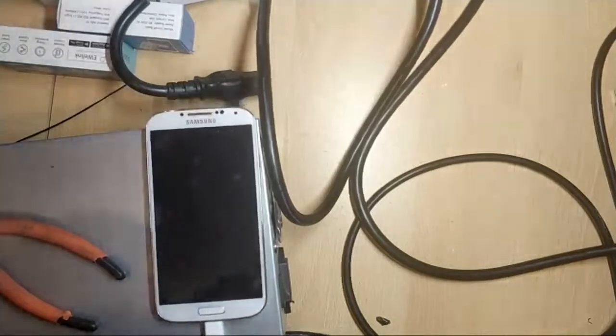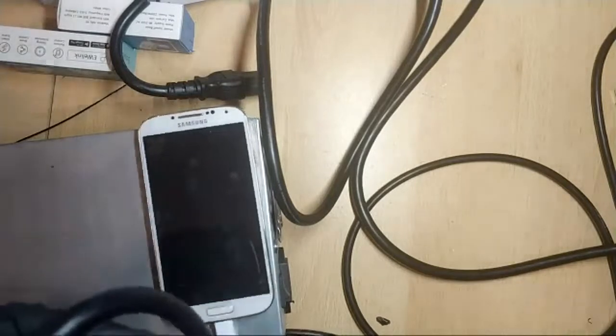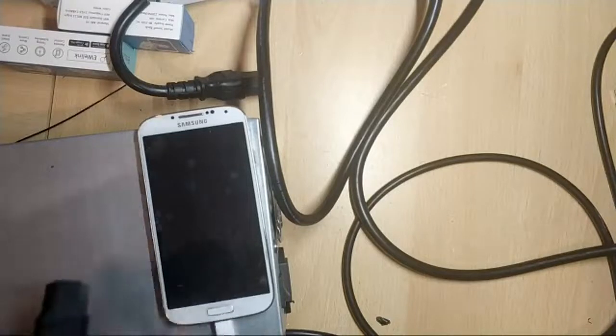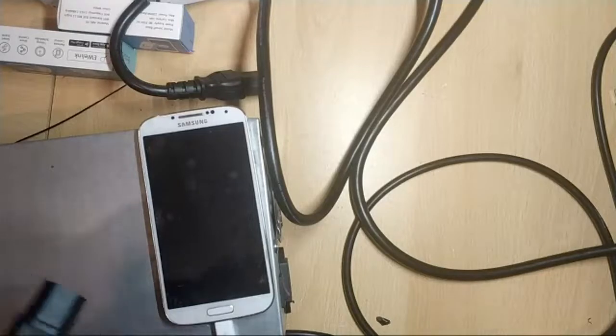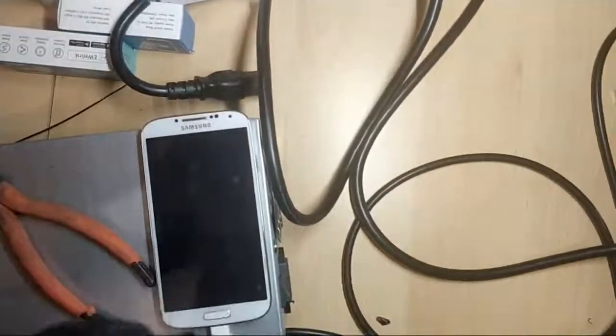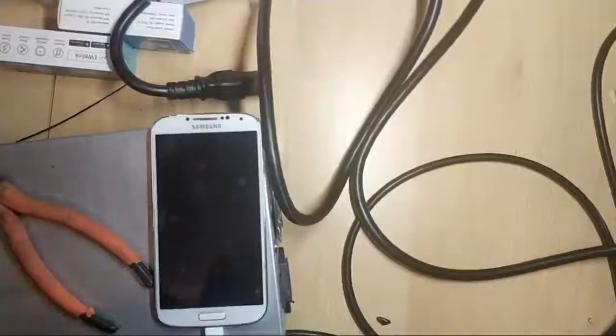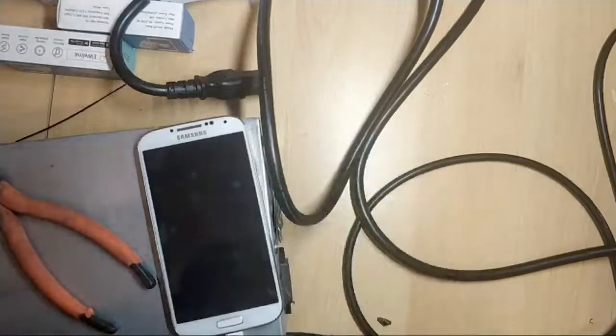It's new to you. It's a lot better than ASIC. You can get some FPGAs which look like GPUs, which are very difficult to program. With this one, the only difference from the ASIC is that you upload bitstreams which are already pre-compiled, so you get that in an email with instructions, or you can use my YouTube videos to find out how to do it. And you just SSH into the miner, which you can do with Bitmain ones as well. And from there, if there's not enough space, you just delete the old ones.